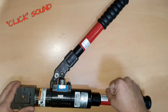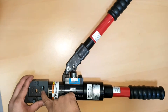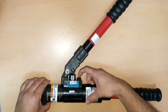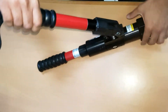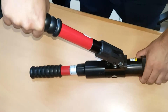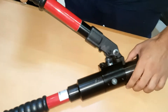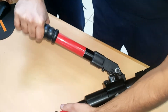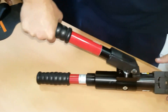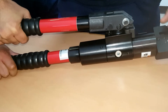Once we hear that tick sound, we have to stop. For unlocking the die and bringing it down, you have to press this plunger. We have to rotate it 90 degrees — just look here. When I take it 90 degrees and press it, it will press that plunger.